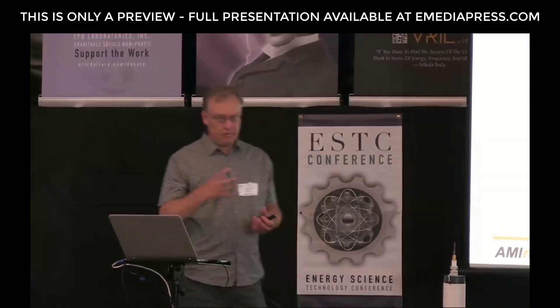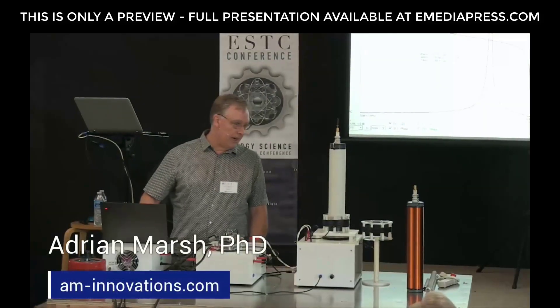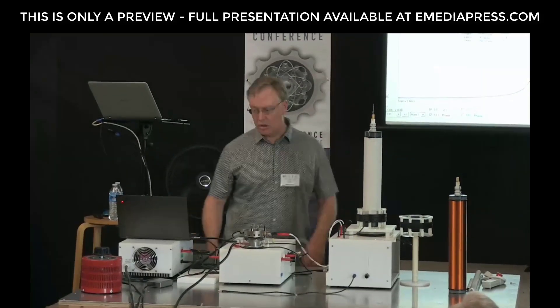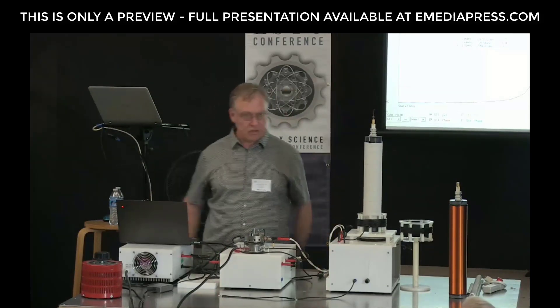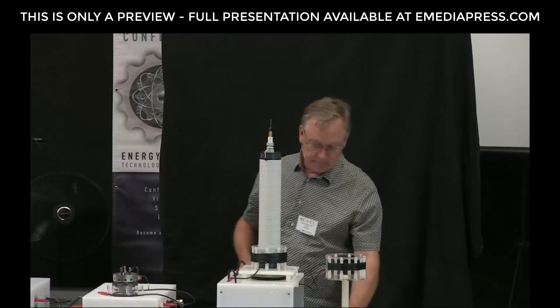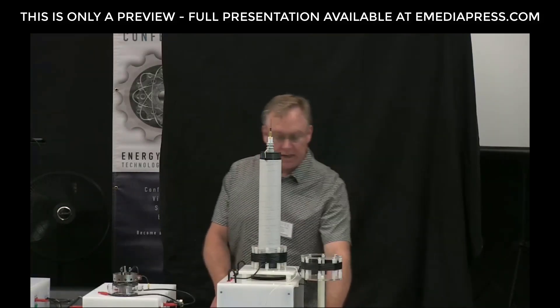The grid and chimney also provide cooling into the system. I want to do a little bit of analysis of what's going on with the coil, because I've talked about the parallel modes quite a lot, and I'd like to show people how that looks and what you can do with the adjustments available. You are actually getting maximum pickup in the tickler coil — the exciter coil — and you can see it in the vector network analysis. Normally I start quite close to get it going, and then find the best position.